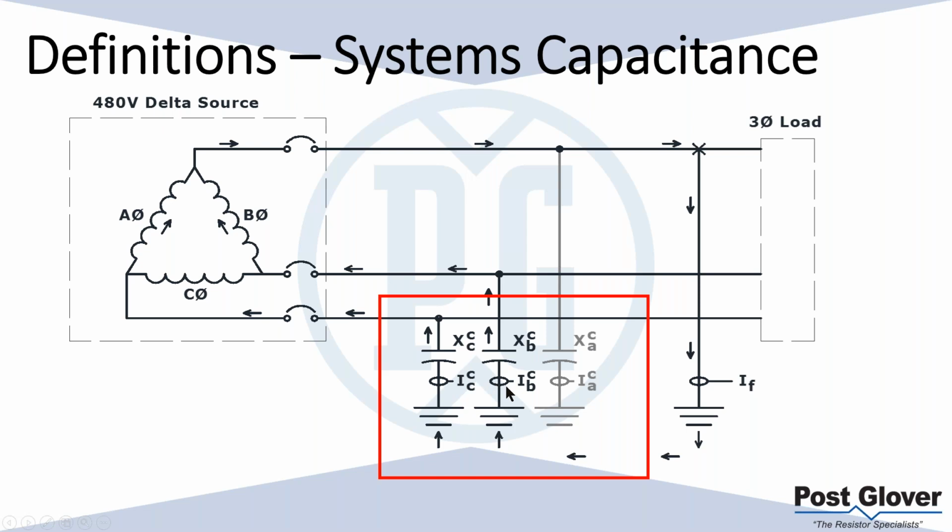One thing we have to worry about when we talk about impedance grounding is that you can have an overvoltage system. For example, in an ungrounded system, if you have an intermittent fault of any kind, it could be an arc fault, it could be a different type of fault. But an intermittent fault, which essentially just means on, off, acts like a switch. Whenever that switch closes, you're building charge. In an ungrounded system as shown here, you don't really have anywhere to discharge this, so you actually build up voltages. IEEE mentions you can get up to 6 to 8 times your rated voltage and overvoltage your system. The same can be true in an impedance grounded system if it is not properly sized. So that's a consideration we need to look at, and something we'll talk about more, but I wanted to define that for you guys, because in a solid ground system, it's not a big deal.